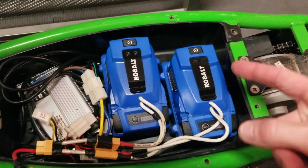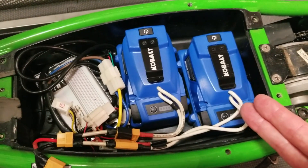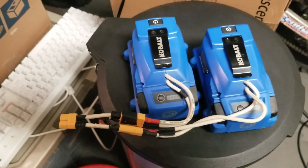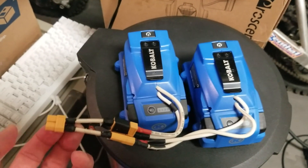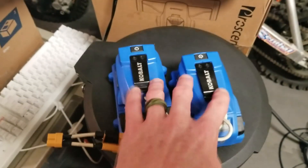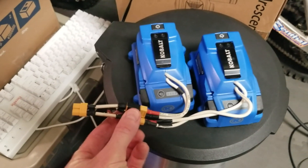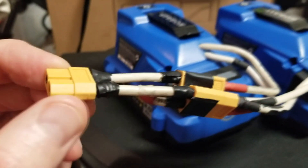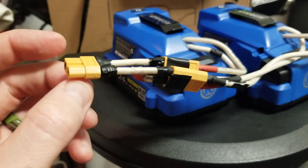These are the batteries inside my scooter. Both power sources are on top of the batteries with a battery reader — mine are about halfway. Both lines are coming out of each power source. We have two 24 volt 2 amp batteries, but now I've created an inline setup so if you put a multimeter on the end you register 48 volts, because both of these equal one now through this connector that feeds into my 1000 watt controller. These are all XT60 connectors.